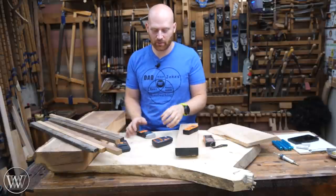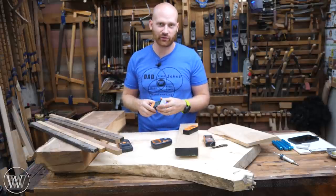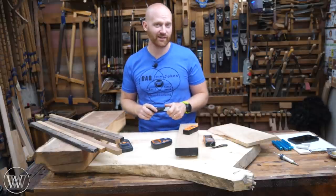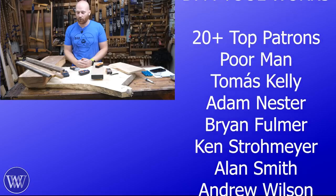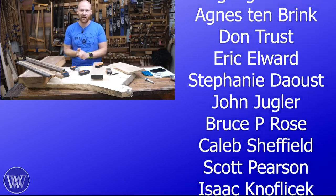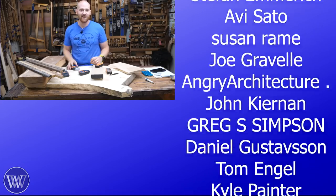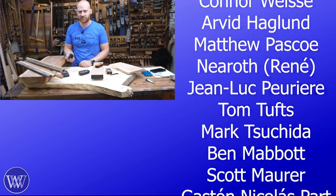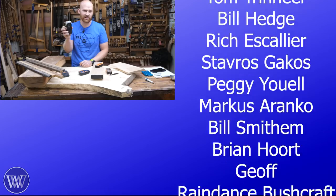So make yourself some stickers and get a regular place where you can stack up lumber, whether you're actually drying it or just storing it in between steps in a project. It's always good to keep air movement around your lumber so that it doesn't warp and twist on you. I will leave links to the meters down below — a pin type, a capacitive type, and the combo one that I like and use regularly — and if you do buy through those affiliate links, thank you, that does help out the channel. I know there are lots more questions, so let me know in the comments and I'll try to answer as many as I can. Thank you to everyone who's buying the shirt and to all the patrons — thanks for helping keep the lights on and the channel going. Until next time, have a wonderful day. Some people might say I have a rather dry sense of humor — 5%... I guess it is dry.